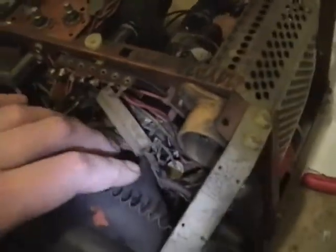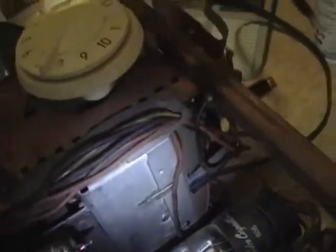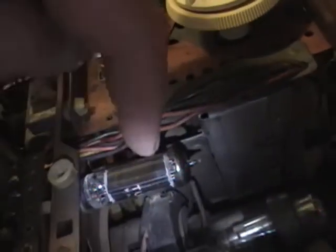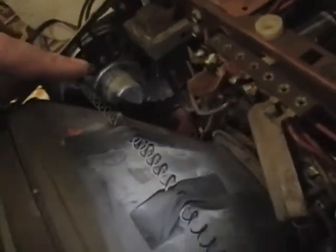It seems to me the best way to get all these components back in here and down there is to pull the picture tube. So what I have to do is remove the plug back here, that's easy enough. Slide off this ion trap magnet and the centering rings and loosen up the strap here, and then it should pull out the front. To be careful about the spring too.